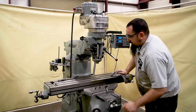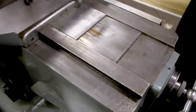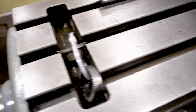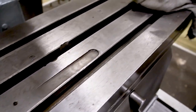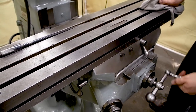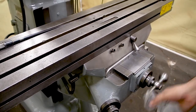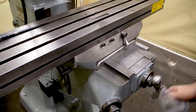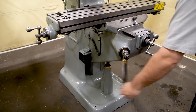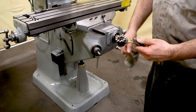Back to the ways — everything goes in and out from end to end really nicely. There are no tight spots. As you can see it goes all the way to the end very nicely, and all the way forward with ease. The knee goes up and down with ease also. You'll notice this handle — somebody broke it at one time and had it brazed back together, but it's perfectly intact and strong, so we're just going to leave it alone.